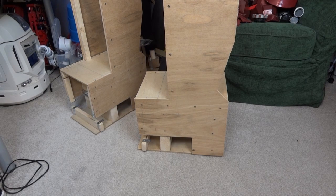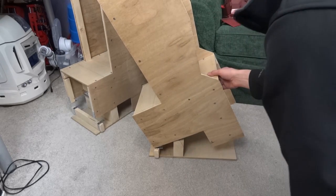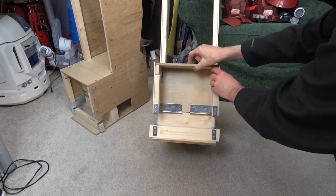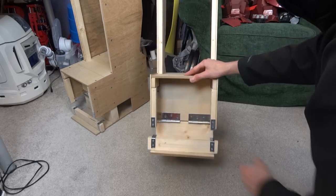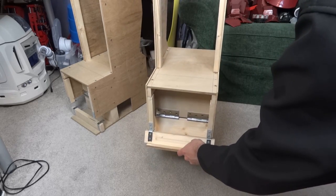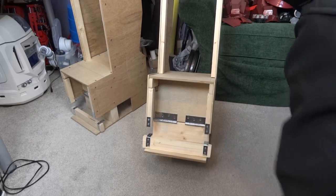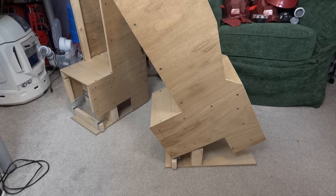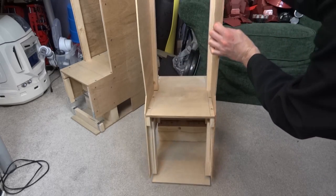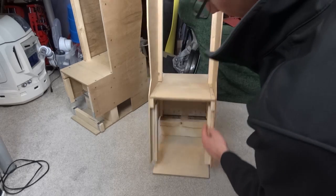What I described with the CAD at the beginning — the flat base with the roll-over hinge on the ball of the foot — we can see there's a flat piece of 9mm plywood, and I've used door hinges at this point. The weight of the wearer sits on another piece of 9mm ply with a square box section, two substantial door hinges, and a big block of wood underneath. I've also put an end stop in so it doesn't come all the way over and you can't overbalance. There are metal plates on the corners to strengthen the wood. In the back there's going to be a spring which pulls this back down so when the foot lifts up it doesn't drag on the ground — it only folds over when you put your weight onto the toe.